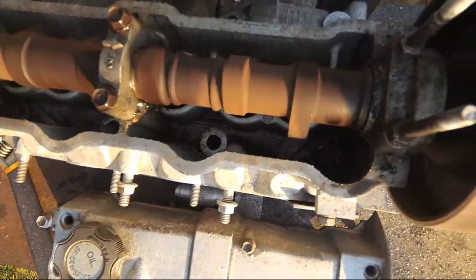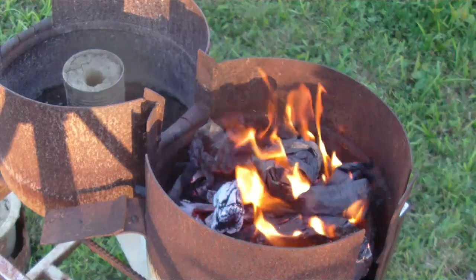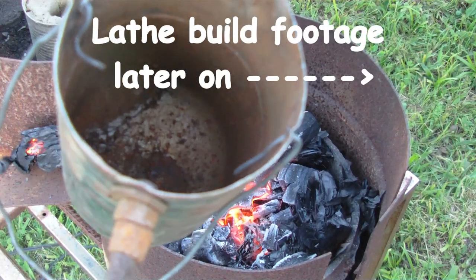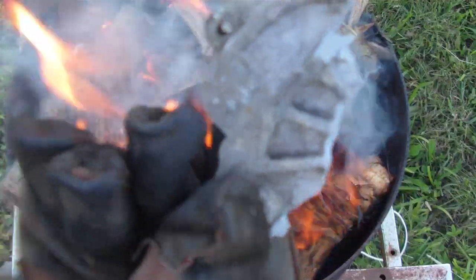Because I don't have any aluminum stock or blanks for the lathe, I'm going to have to go over to the forge and try to melt down some aluminum fans. I'm using a propane bottle — of course there was no gas in it, and it was completely filled with water before I cut into it. It's only been a few minutes; chunks of water pump are going in.